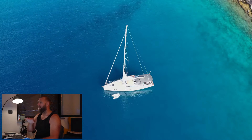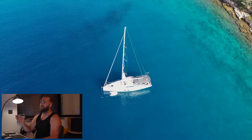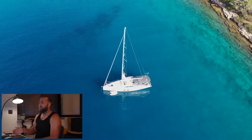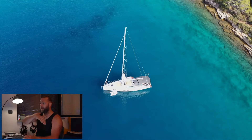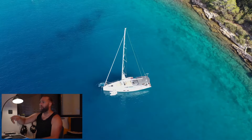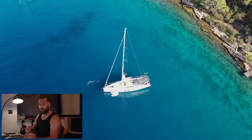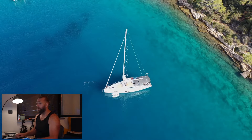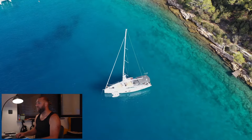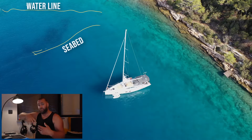We've got our 15 meters down and I'm starting to move backwards — the anchor chain is still vertically down. I can see I'm moving backwards because the dinghy has come forward and is laying against the bow. I'm now moving backwards towards the shore and laying chain along the seabed, asking her to keep paying out — five more meters, go to 25 meters, go to 30 meters. I've done a small bow thrust to straighten up. The anchor's started to grab and it's coming up the slope of the seabed, so it's going to get good holding there.